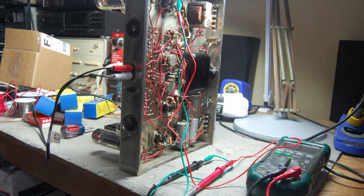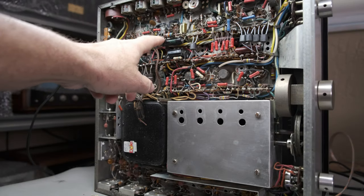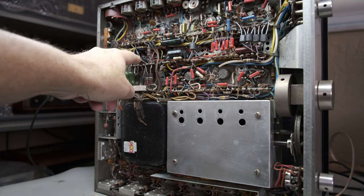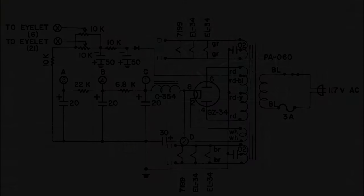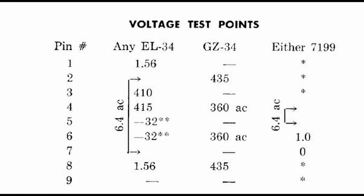It's the same way with a lot of this 50-year-old, 60-year-old vacuum tube audio equipment — you're going to have to tinker with it a little bit more to keep it running. Now let me get into the dangers of working on vacuum tube audio equipment. The danger with vacuum tube units has to do with the voltages that these units routinely use. All of the amplifiers and receivers that I showed in this video that I own — they all have voltages of 400 volts or more in them. That's a lot.